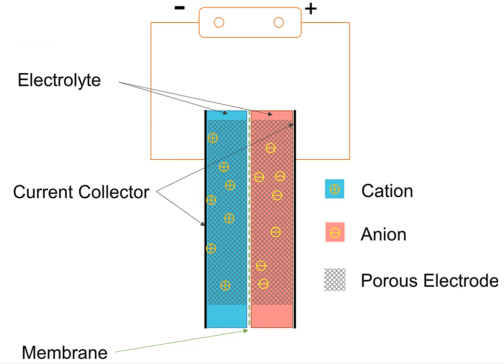For comparison, an aluminum electrolytic capacitor stores typically 0.01 to 0.3 watt-hours per kilogram, while a conventional lead-acid battery stores typically 30 to 40 watt-hours per kilogram and modern lithium-ion batteries 100 to 265 watt-hours per kilogram. Supercapacitors can therefore store 10 to 100 times more energy than electrolytic capacitors, but only 1/10 as much as batteries.